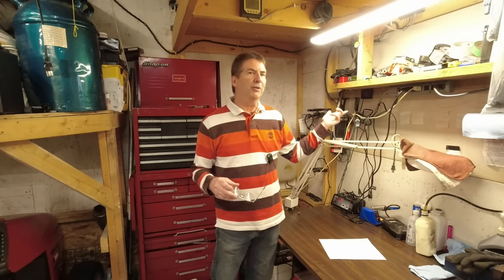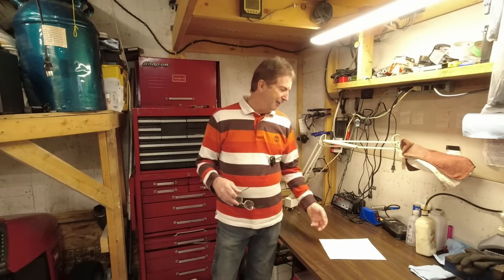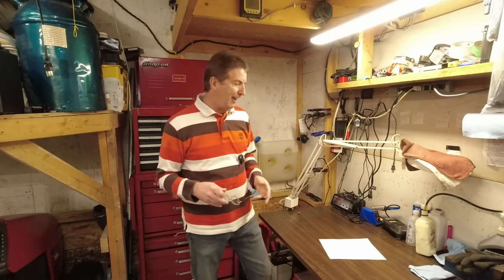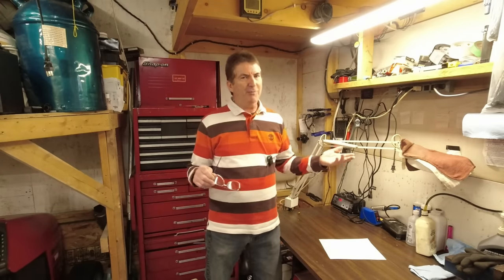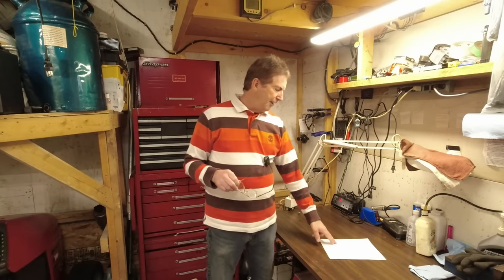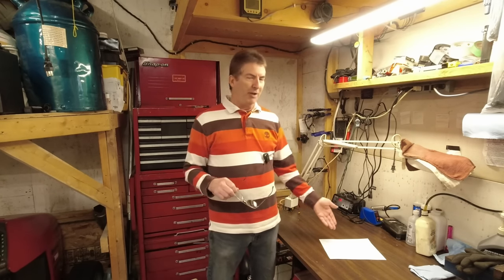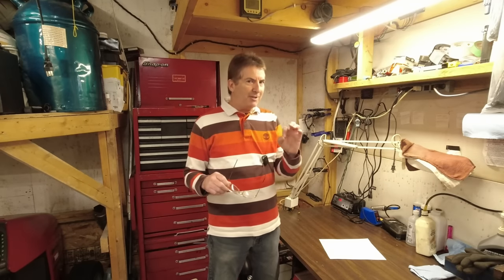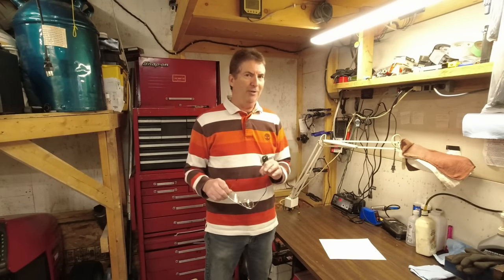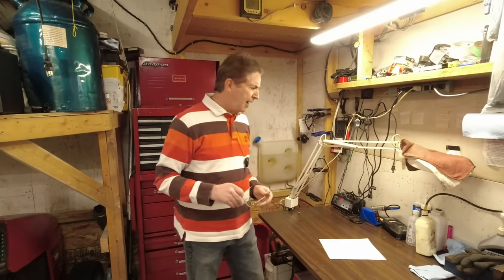Running at two kilowatts, I go through one liter of fuel in about five hours and fifteen minutes. At two kilowatts it doesn't matter how cold it is outside — it's going to produce 6,824 BTUs regardless, whether it's minus 15 or minus 20. If you bump up the power setting you'll go through fuel faster. So no, it doesn't sip fuel — it gives you the energy that diesel stores, and if you want more heat you'll use more diesel.